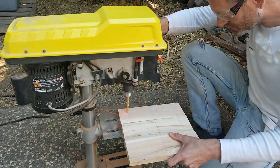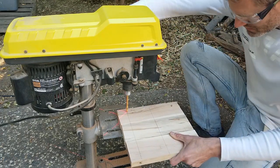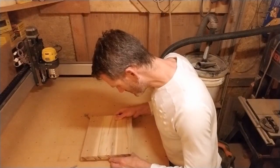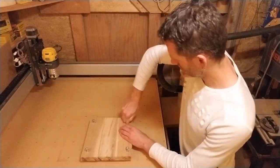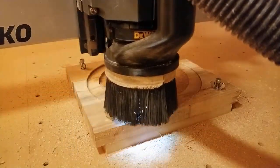I also found a small leftover board that I'll shape to fit the epoxy pedestal. I drilled four holes into the board that matched the position of the clamping holes. I secured it together with a piece of spoil board onto the CNC bed, then created the pocket in the center and cut it out with a slightly rounded, beveled edge.